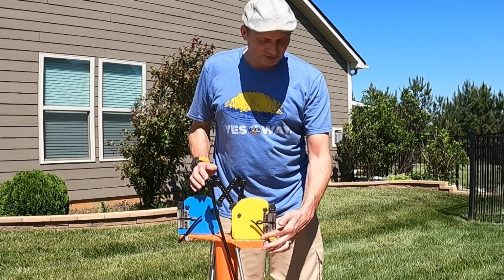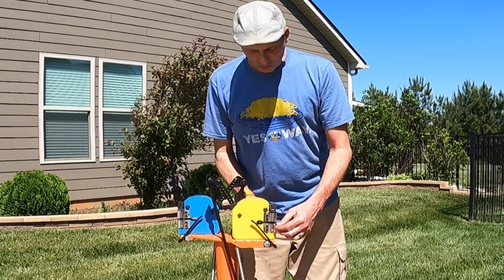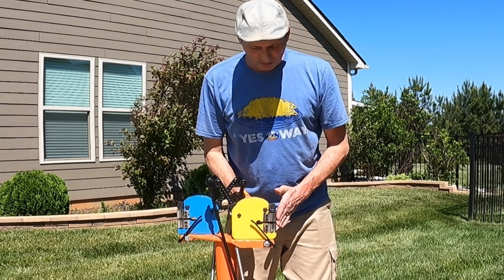Same reason I put on these fences that I made. You're supposed to only engage like half of the metal for optimized work. And if you have a 2-inch piece and you only want it to go in 1 inch, you can loosen these bolts, pivot the guide forward, and set it to the depth that you need for whatever piece you're working on. All that adds up to more precision in your metal work. However, over time you probably wouldn't need that. You'd probably be able to eyeball it pretty good yourself. Same thing with getting a feel for how the pedal works. But hey, let's see how it does work.